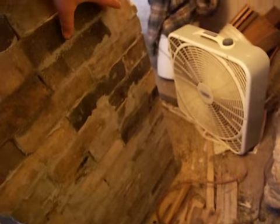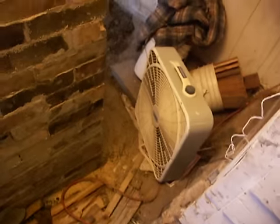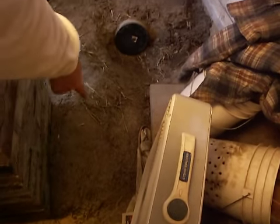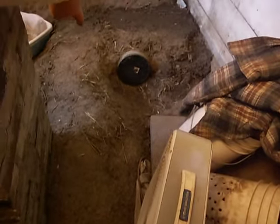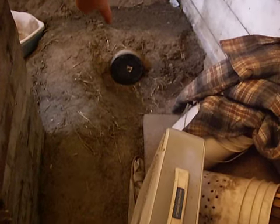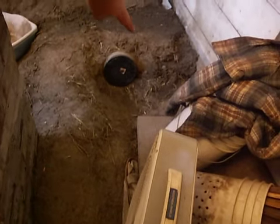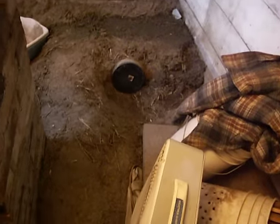The downdraft goes down to where the exhaust goes out. It comes out of a 90-degree elbow stovepipe over there — a 90-degree elbow — through a tee, straight underneath my wall, through the stand and the cob material here, out to a chimney that I have outside.